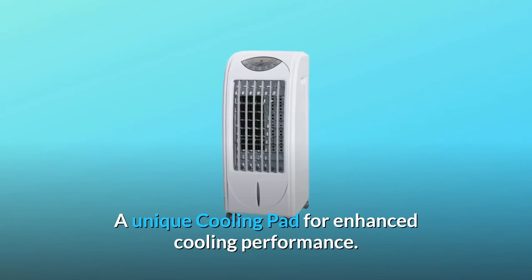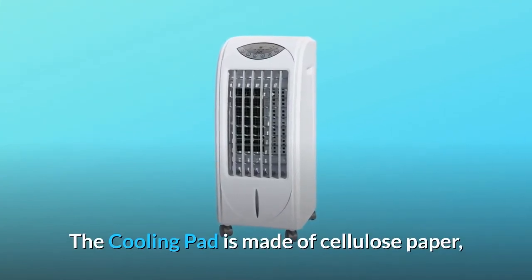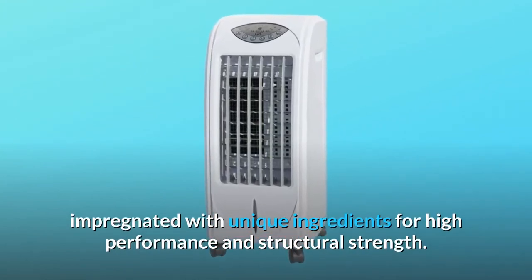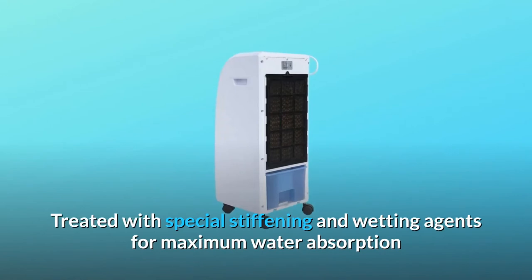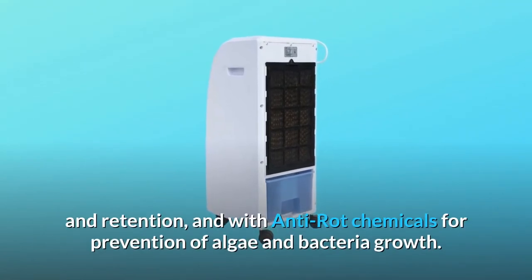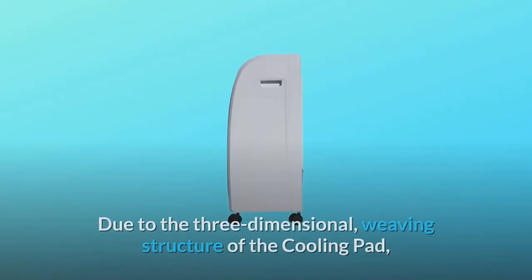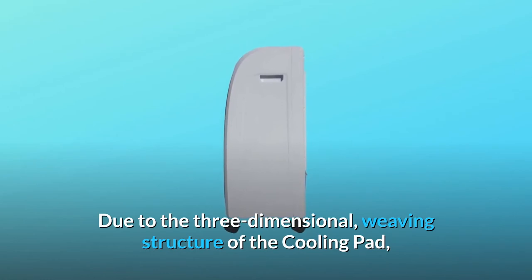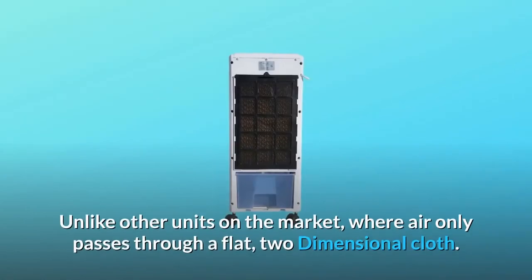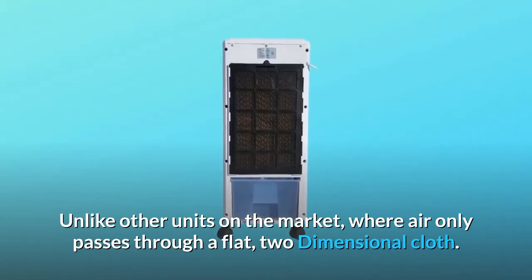A unique cooling pad for enhanced cooling performance. The cooling pad is made of cellulose paper, impregnated with unique ingredients for high performance and structural strength. Treated with special stiffening and wetting agents for maximum water absorption and retention, and with anti-rot chemicals for prevention of algae and bacteria growth. Due to the three-dimensional, weaving structure of the cooling pad, there is longer contact between air and water, unlike other units on the market, where air only passes through a flat, two-dimensional cloth.